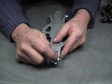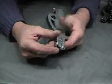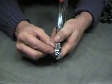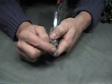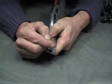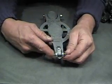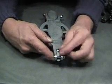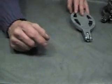I have put a nylon adjustable bushing bearing in here, and then also this area here, it's very difficult to see, but I have had this professionally welded. This aluminum has been beefed up, and then I've come in and shaped it down a little so that it's not real obvious, but it's still a thicker, beefier area at this stress point on the footboard.